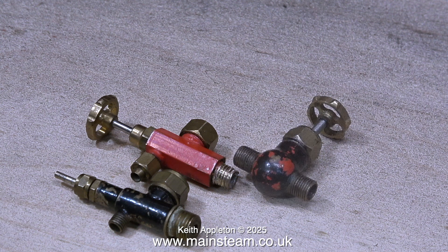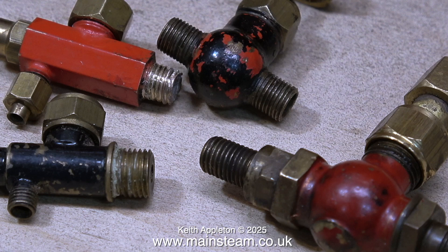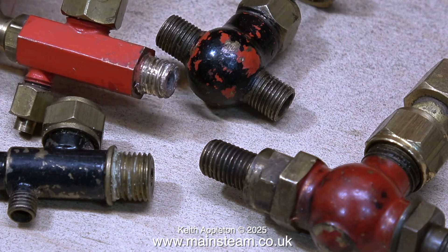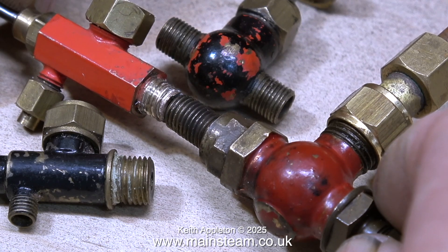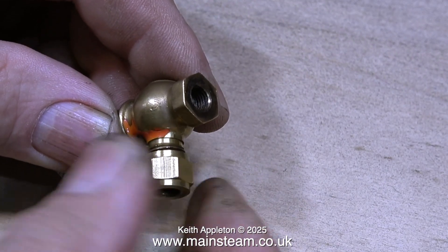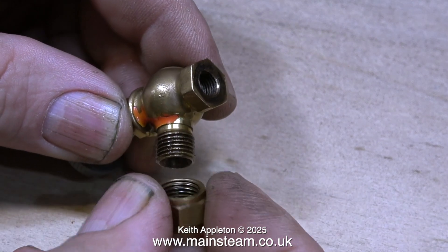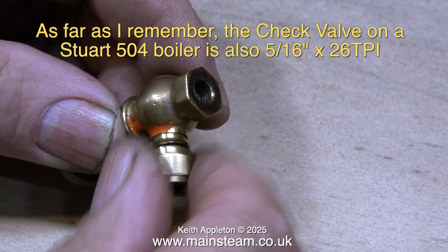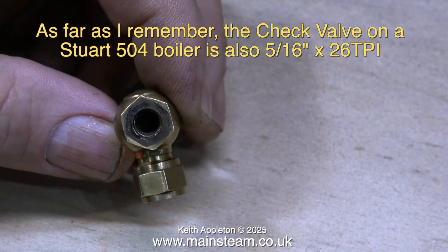Here's another type of water gauge fitting — this one is 5/16 by 32 — and a globe valve at 1/4 by 40, and another Stuart valve with an adapter fitted. Just look at the state of this one: you must never do this. It's a complete cop-out because the thread will fit either 1/4 by 32 or 1/4 by 40, but not very well, and it's really bad practice. This is another early Stuart Models valve, again threaded at 26 threads per inch. The original Stuart valves used a stainless steel adapter that screwed into both the boiler and the fitting — which was a good idea.